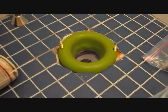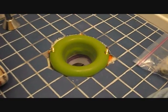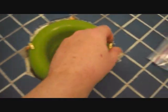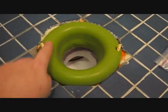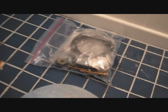I've started to take the toilet apart in my bedroom, and here's the accoutrements in the bag here. So I'm going to shut the camera down and do some study, and going to sit the toilet on this guy, and hopefully he'll sit flat on the floor, or maybe I have to shim him a bit. Bolt him down carefully. Don't over tighten these nuts, because people have been known to tighten them so hard they crack the porcelain flange of the toilet. Just enough. So I have probably 3 sets of every nut and bolt.